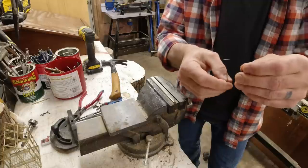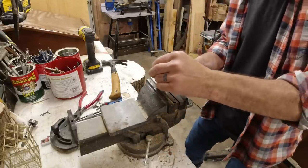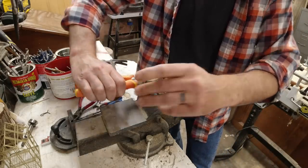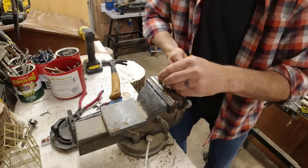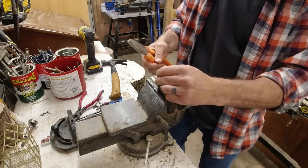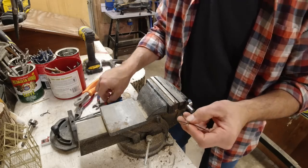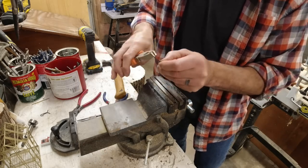I'm just going to put them in about an inch into my vise — you can do this with double pair of vise grips, whatever — fold them over and give them a little bend, like so. See a little kink on there. Now I'm going to put it back in the vise, tighten it up, and take my pliers — just going to do three winds, give or take a wind, nice and tight too. If you find that when you take it out of the vise it comes apart, you didn't do it right — it shouldn't be sloppy. Take little nippers, nip the extra piece off, crimp it down.